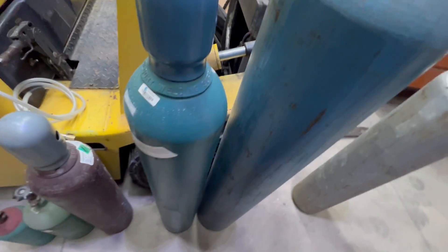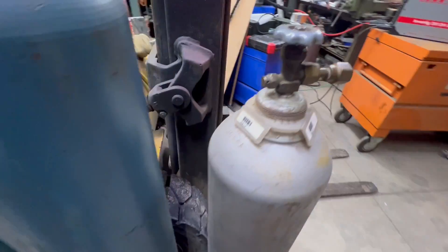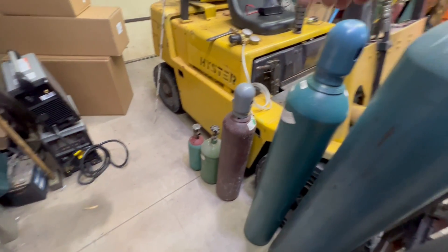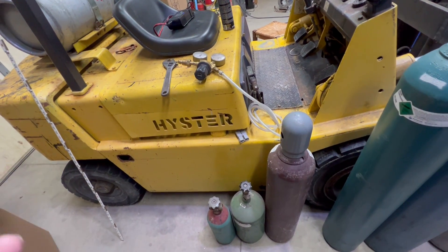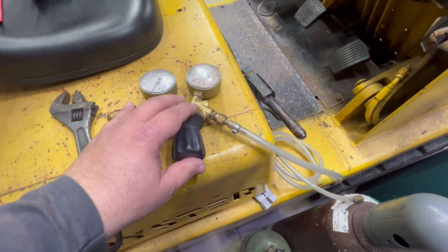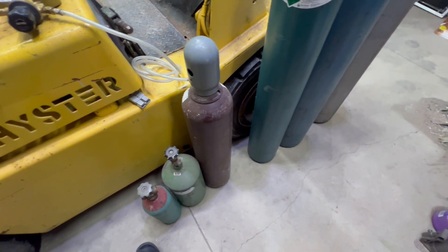As a little bonus: this is a 100% CO2 tank. CO2 has a different adapter, and if you want to use your regular argon regulator you need to run an adapter fitting for 100% CO2. Even though nitrogen also gets sold in tanks with a CGA 580 connection, never use a nitrogen regulator for welding gas — because nitrogen has a pressure regulator, not a flow regulator, and it goes from 0 to 500 PSI on the low pressure side. These welding regulators regulate flow and typically don't exceed 50 or 60 PSI on pressure. On nitrogen, you typically regulate pressure.